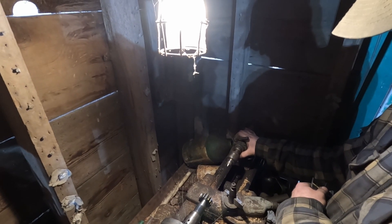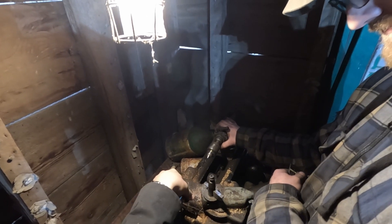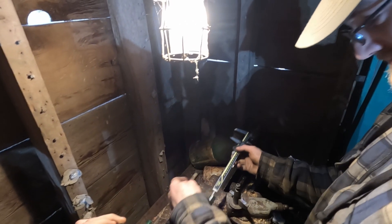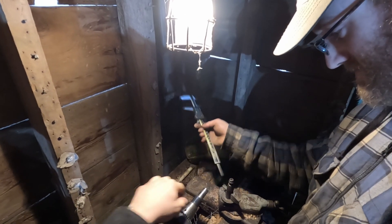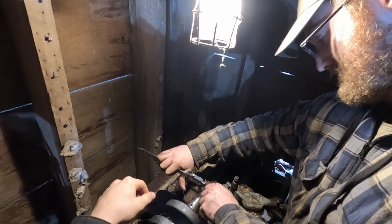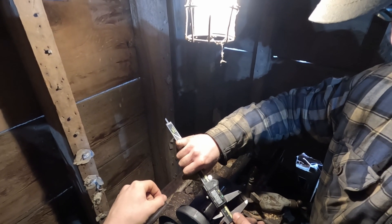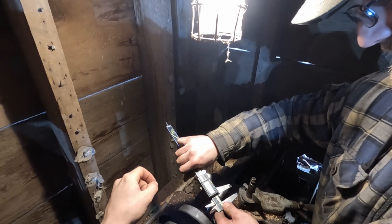You can see where he cut just a wee bit too much for the gear, but it'll be fine for the planetary. We still got a pretty much perfect fit there, which is just cherry. Since this is supposed to be instructive, take a caliper measurement — the shaft is so 0.759 basically. You can squeeze up on it a little bit.